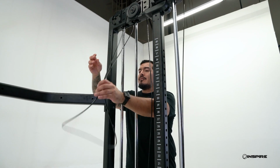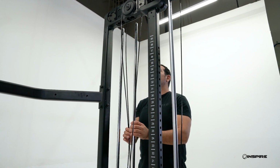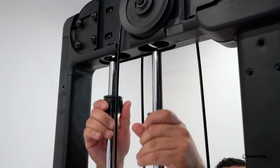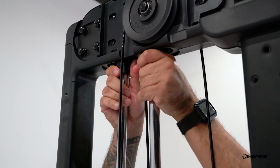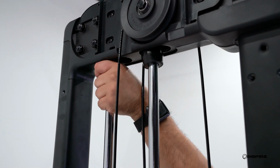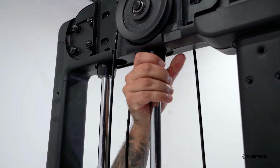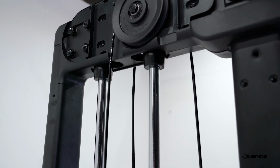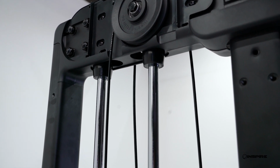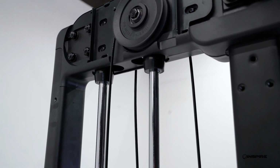With the cable positioned between the 2 guide rods, carefully pull the guide rods toward each other. Then slide the guide rod bushings up into the larger hole of the frame until the slot of the bushing is resting in the frame. Next, pull the bushings along with the rods away from each other so that the bushings slide into the smaller holes of the frame, thus locking them into place. Repeat this on both sides.